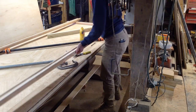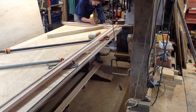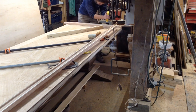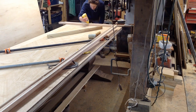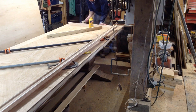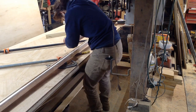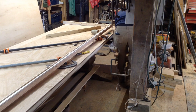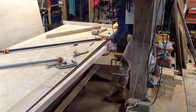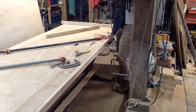You can see I have those pieces of plywood in there — I'm going to use a liberal amount of glue on all these. What I did was glue the two edges first because then the long pieces will kind of hold into place. This process just got really difficult — it's hard to not be able to move easily around the piece you're working on. I'm just hammering that into place, then I do the same for the long edge: add a bunch of glue in those grooves, add the plywood, add more glue, put some glue in the grooves on the actual table, and then use those notches already on the edges to get this in place. Then I could put some clamps on and that's how I have that exterior frame.